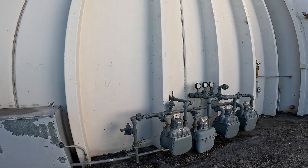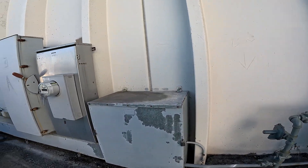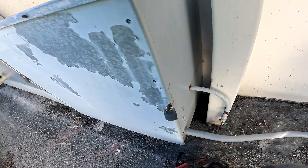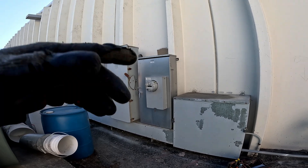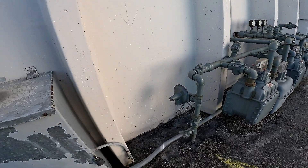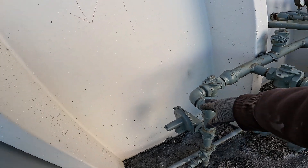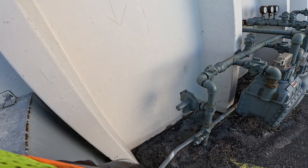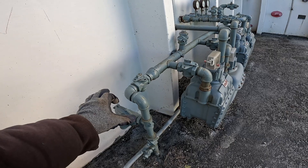I have no place to ground out here — everything's all asphalt. You definitely do not want to ground out on this power line right here. If you ground up here while working near this power line while marking a gas service, that's a big, big mistake — a no-no. Also, anything after the regulator is all insulated, so when you ground out here your tone is not traveling down that way, it's traveling back.